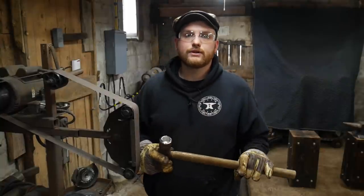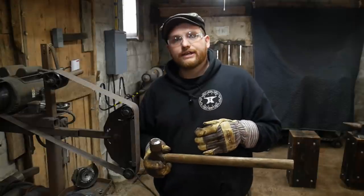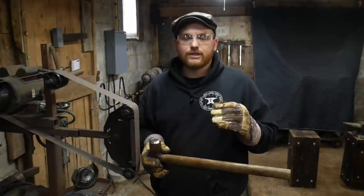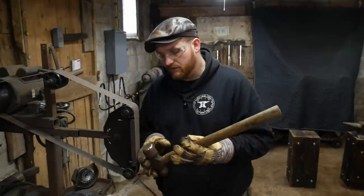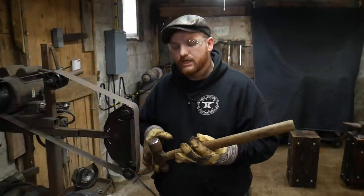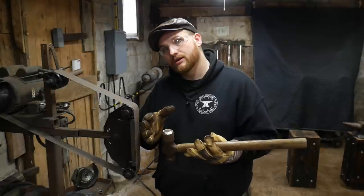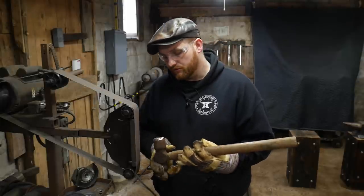Okay, so there you have it. So that's taken off that next stage, and now basically we're just going to keep doing that. If you need a much steeper or a much more domed effect, then you just cut down your sidewalls a little higher. The edges that you start with, you bevel them more, and then continue to go through those steps.